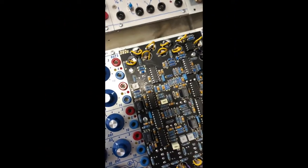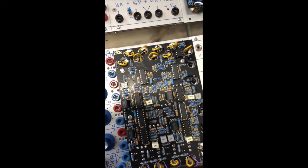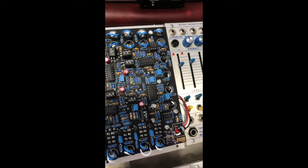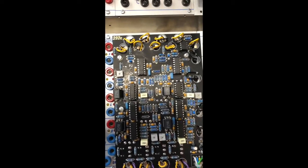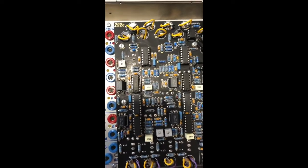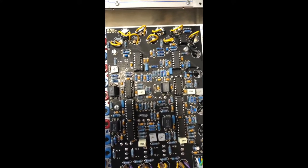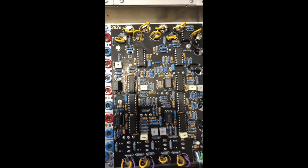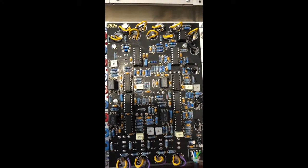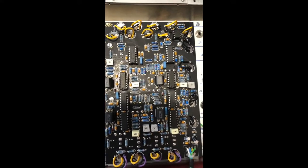All right, so I wanted to take a few minutes to just show off the PCBs for the two Gates circuits, the 292C and the 292B. And right off the bat, major difference of the C is that it uses 4 dual Vactrols. I've got Augustus Technologies Vactrols, which are now new old stock. The reason being is that they function better in this circuit for better decay, and these were matched. And also you can see that there are far less capacitors than in the B.